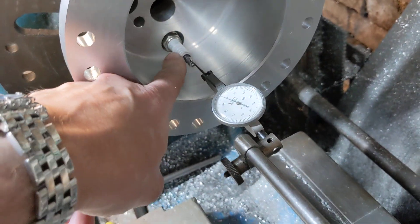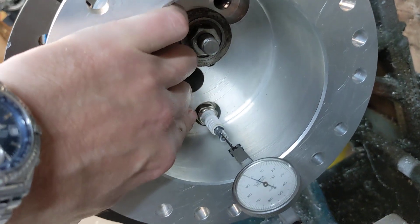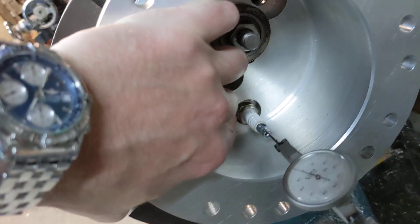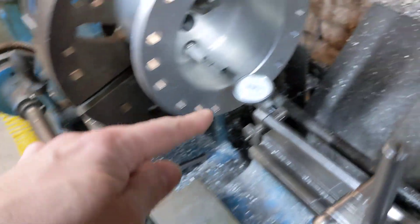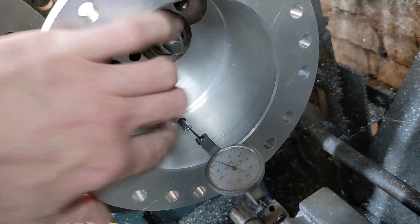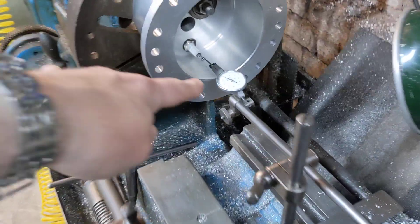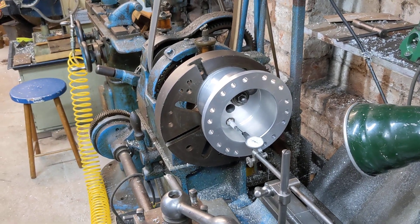So tomorrow we'll take the spark plug out. You can see that the relief hole at the moment isn't quite concentric to where the spark plug is, so that needs to be resolved. It will be resolved when we bore it out with this boring tool here — we take the clock away, we wind in the boring tool, and then we bore this relief out. So yes, in all not a bad day's work. That's a very quick update to show you how we clock it on centre, and what's happening next. As usual, thank you for watching — more updates will follow.